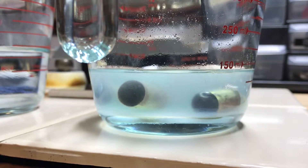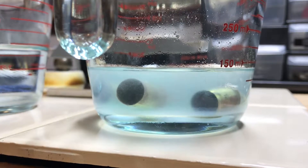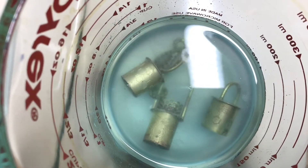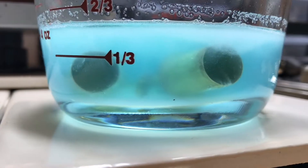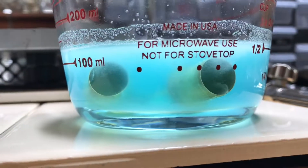As the hydrogen peroxide does its job, you're going to notice bubbles, and your solution is going to slowly start to turn blue. The blue is actually the copper molecule falling to the bottom of your bath, so that's exactly what you want to see. We're going to leave them in there for about 15 to 20 minutes and check back in then.